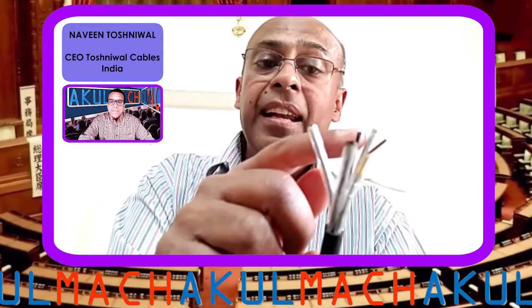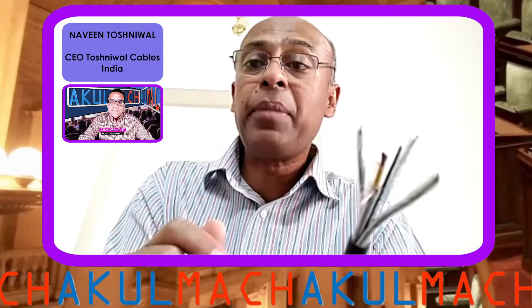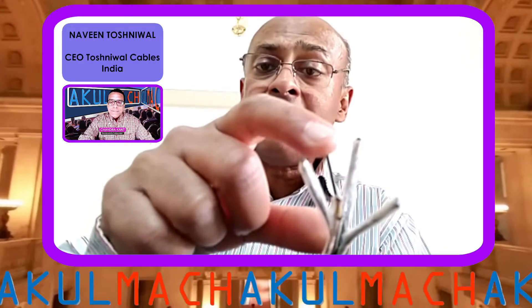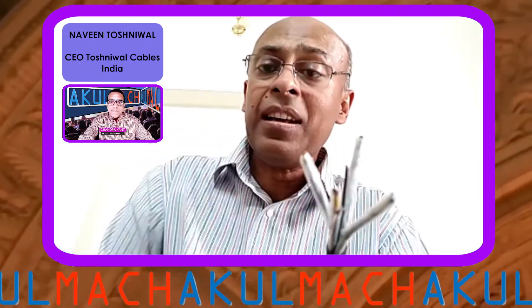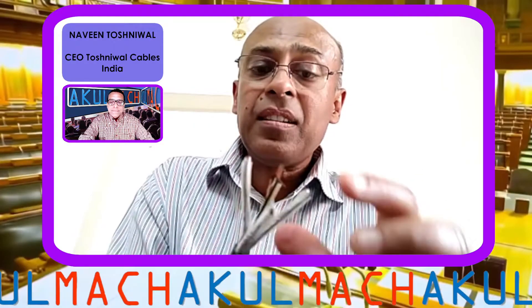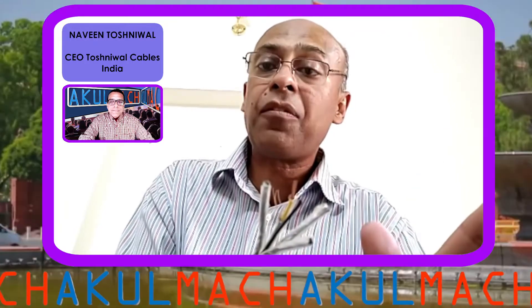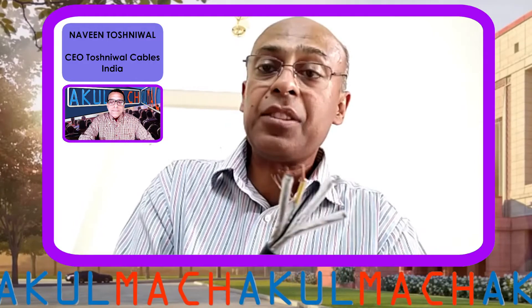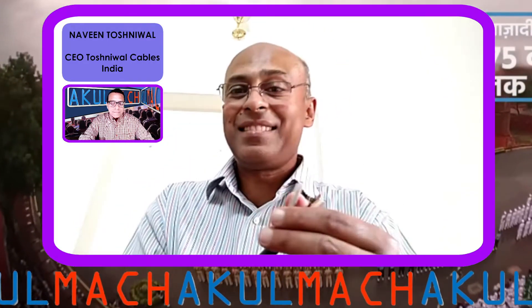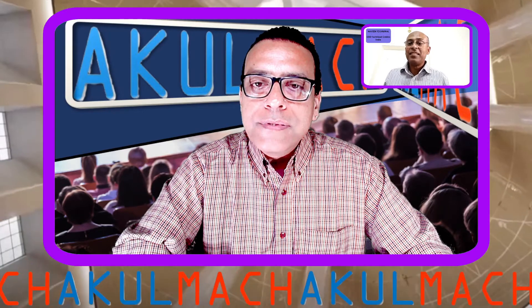Each pair is shielded to provide electrostatic interference reduction. This individual shielding is required when analog signals are being carried in the cable. Another feature: in the middle you will see a blank core — it is just a pure simple PVC core. This is just to give a round shape and good finish to the cable. It has no electrical purpose. Outside you will find a sheathing of PVC. So this is a four-pair signal cable which can carry four simultaneous signals at a time, maybe from RTD or any other measuring or control instrument, and it has got individual pair shielding.